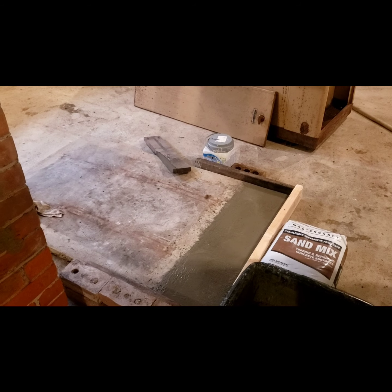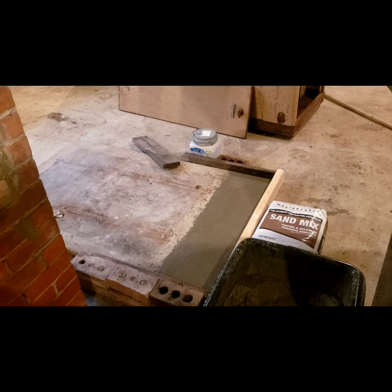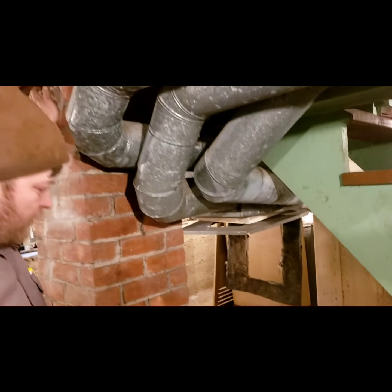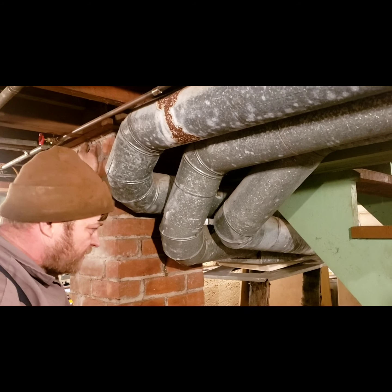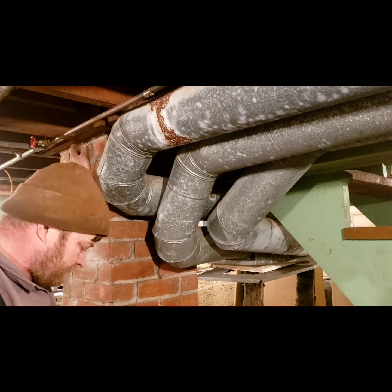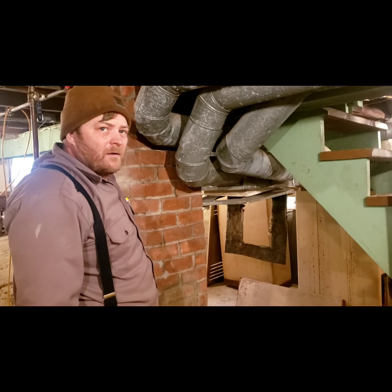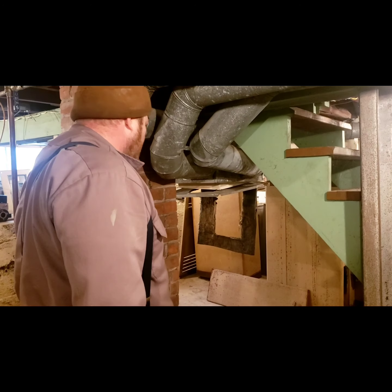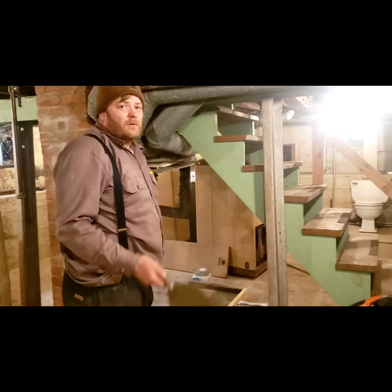The only thing he did wrong on the whole installation, for as old as it was, is the smoke chimney pipe going in too high, next to combustible material. But he did everything else perfect. He ran his own dedicated wire. A lot of people didn't start doing that till later, but he did it right off way back. So he did it good. It's 72 years old, and it still ran.